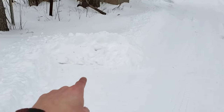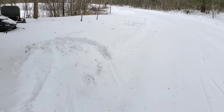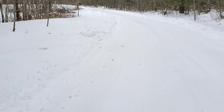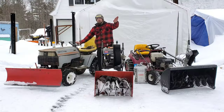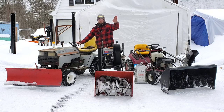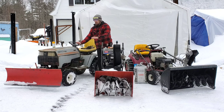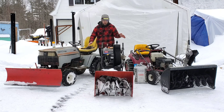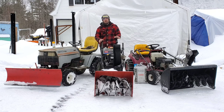about every 20 feet down the driveway, you cut a relief into the side of the driveway. And what that does is, as you're driving down through, breaking out the snow with this, it'll dump it off into that relief cut about every 20 to 25 feet. And that allows you to reset with the plow and to be able to continue pushing. At about 6 inches, no issue whatsoever. About 6 inches worth of wet snow, no issue whatsoever. The moment you clear about 10 inches worth of fluffy, you better have those relief cuts that are done with this. While we're on this, it is amazing to use one of these to do walkways.